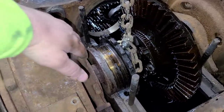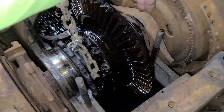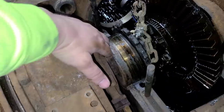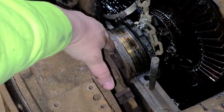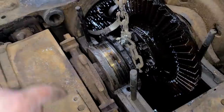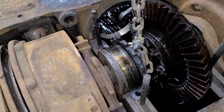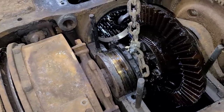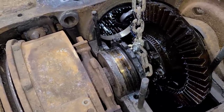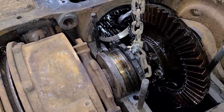In the book they want you to wrap a cable sling around this side and then the other side, to balance the shaft. I don't have anything small enough to fit in there, so I just moved my chain to the center — or close to center — and I'm hoping I can balance it enough to get it out. If it seems like too big of a problem, we can set it back down and try something else. But let's give it a go.